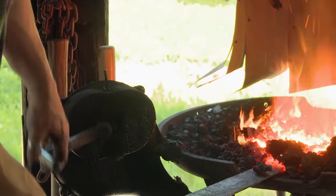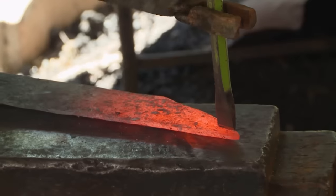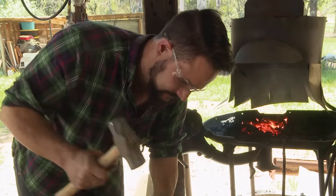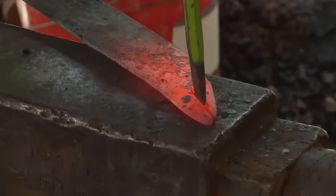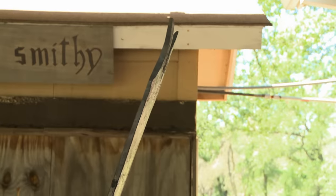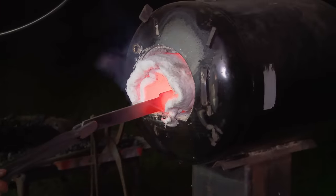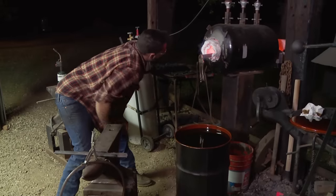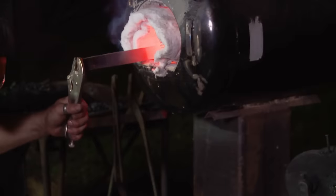Today I'm going to cut the spur out of the tip of the blade. There's a lot of bad things that can happen here. Taking a chisel to any part of your blade can result in unfixable blemishes. Time for the heat treat. Heat treat's the worst part of any blade-making process, so I'm incredibly nervous. Warping is the number one concern I have. When I dunk the blade into that oil, it's going to do what it's going to do, and there's nothing I can do to stop it.